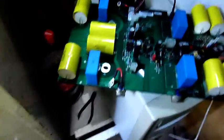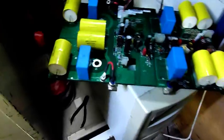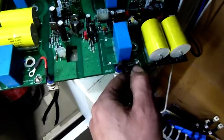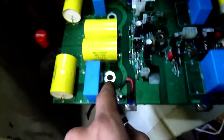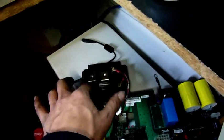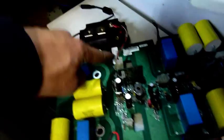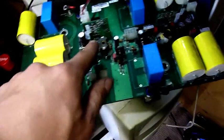Here's one of the old boards with a one microfarad 1200 volt DC polyfilm cap across it. You have two red positives and two blacks which I think were negatives, or at least just colour-coded that way. There's DC positive on the red side and DC negative. They had single pack IGBT bricks, all of which I still have — I think they're 1200 volt 400 amp bricks. They plug in there like that.